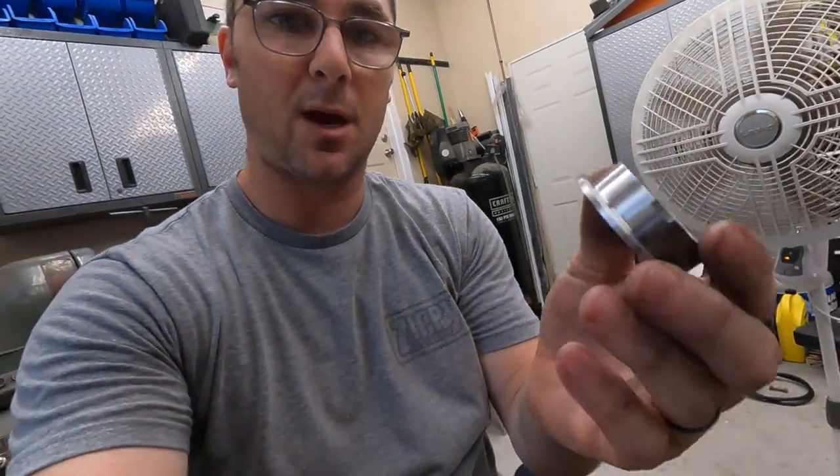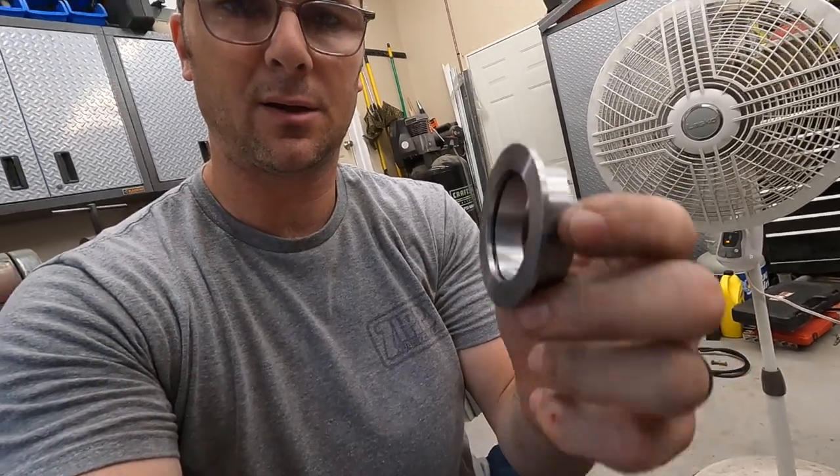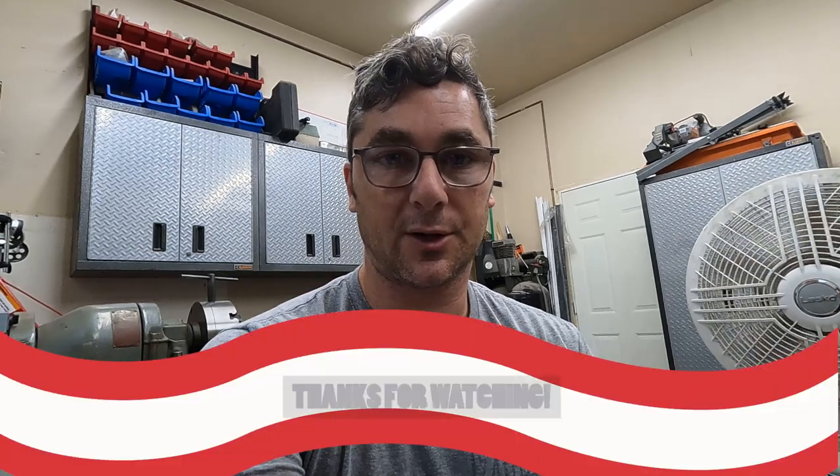There is one thing. This came in the mail yesterday, or maybe from Friday. I don't know if you can see it. There is an O-ring inside of that spacer. So hopefully that will fix our transmission leak. We're gonna assess the main gear bushing in there, make sure we don't have a lot of excess play, which could be causing our transmission leak also, or contributing anyway. But next thing we will be doing is tearing that back apart and fixing that transmission leak finally.